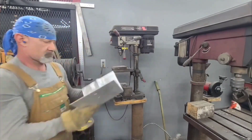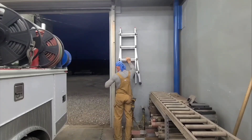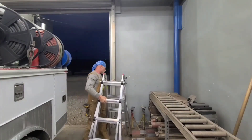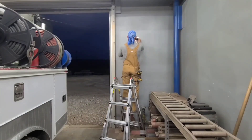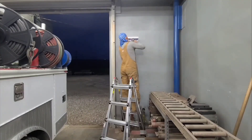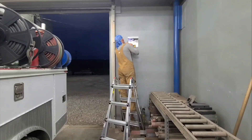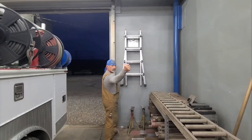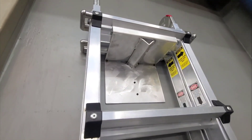The reason I'm doing it this way is I know I can hit a stud on my wall here. The walls in my shop are a fireproof plywood that I've done drywall taping mud on — instead of sanding it smooth, I just took a wet paintbrush and smoothed it out. When I get up there and look, I can see where the tape is, so I know where the studs are. I put a couple of drywall screws in the center, and this plywood is thick enough it would probably hold without the stud. I'm putting a couple of drywall screws up through there on each side.